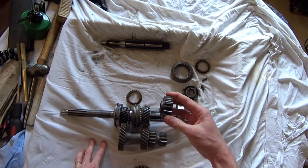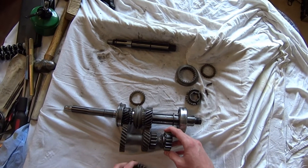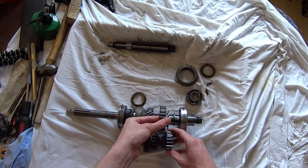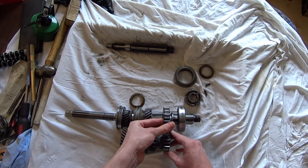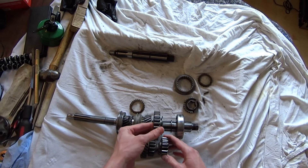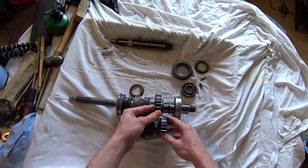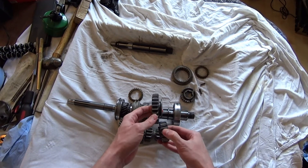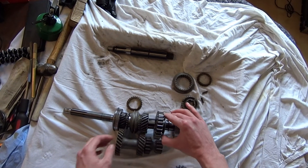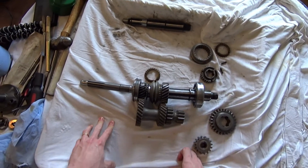That's why you get a lot of damage on these engagement teeth. That is a non-synchronized gear. Reverse is exactly the same — it's driven off this little counter gear here, which rotates in the opposite direction. So in neutral, you put it in reverse, slide it across, it engages and rotates the wheels in the reverse direction. But again, if you're moving it can clash and you'll get damage on the teeth, so you have to be stationary for reverse as well.